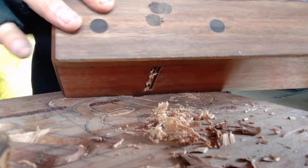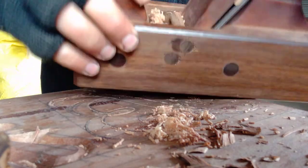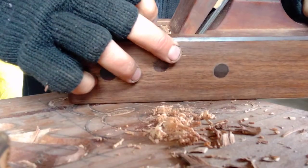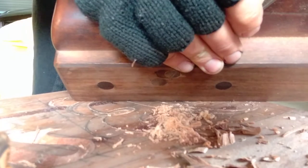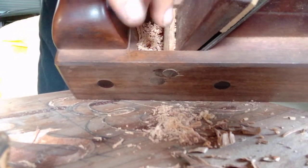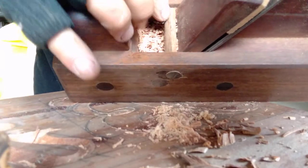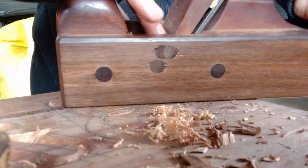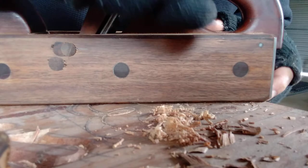I've made a series of mistakes as you can see, just trying to get the wedge and the through hardwood dowel in the correct position. At this last position I have stuffed up, but on the inside of the hardwood dowel I've made a flat spot so that the wedge meets that flat spot. It's still wedging itself in there nicely, and being a round dowel that's not fixed — it's just going to wedge itself nicely every time you put the wedge in, which is what you want.